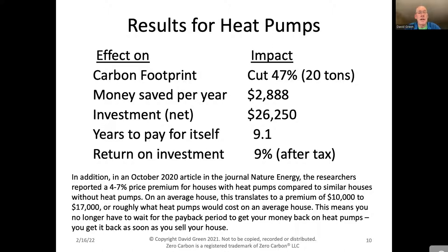If you're going to sell your house and aren't sure about a 9-year payback, adding heat pumps still makes sense because they increase your home's sale price. Solar panels also increase the price of your house. The heat pumps I'm talking about are air-source heat pumps — not geothermal. Geothermal, or ground-source heat pumps, are very similar technology, but we got a quote of $98,000 for geothermal — four times the cost of air-source heat pumps. Geothermal is one of those things that makes energy sense but does not make financial sense.